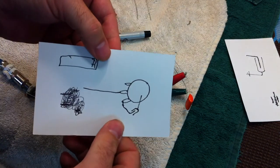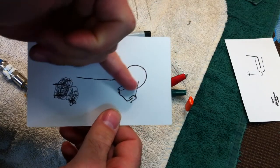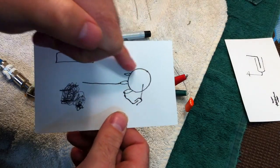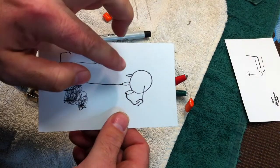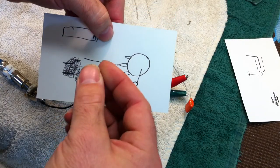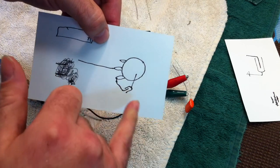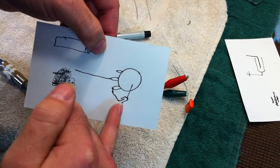Again, this is my preferred method for doing it. This hotter side is still kind of bleeding some stuff over into the signal that you're getting from the guitar — it's not a ground plate, as in the wiper in here is not a ground plate. The back of the potentiometer is definitely a grounded surface, but you may still hear stuff coming from the wiper. Like if you ever listen to a tone pot that's dirty, you can still hear it crackling — there's still something going into your hot, which is why this lead will still tend to pick up some noise. When you shield it, you'll get less of that, which is why you want that orientation to be correct.